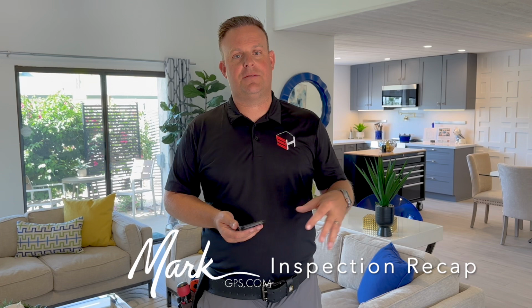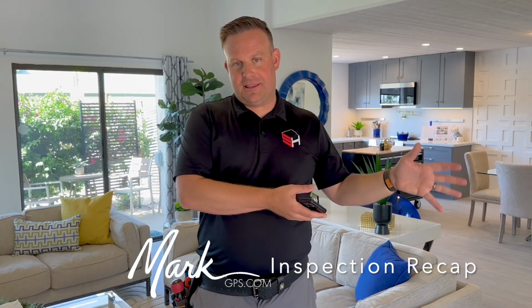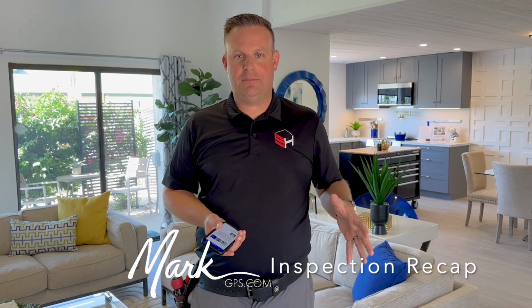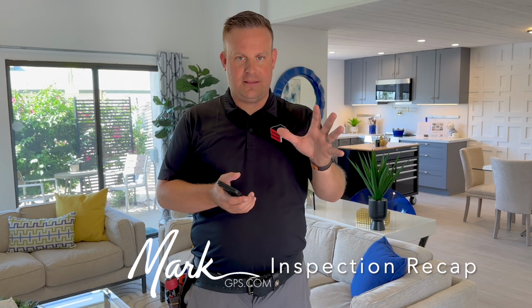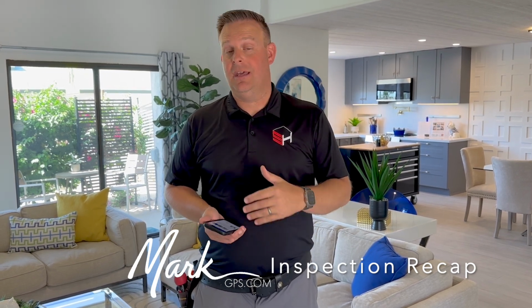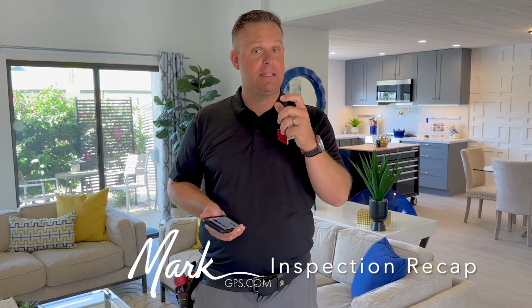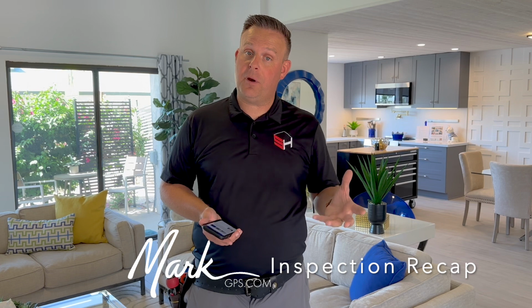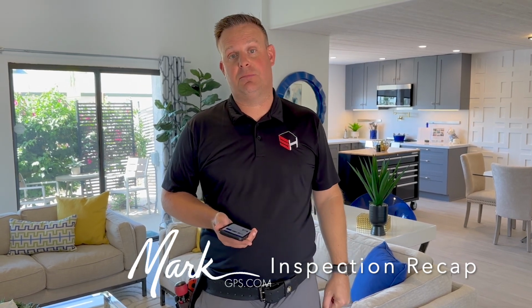You'll see that has a narrative that says, hey, they've been known to fail. I always tell my clients, go online, read about them. They'll try to scare you with, oh, this and that. I opened up the panel, I used my thermal imager, I didn't see any signs of excessive heat. Everything looked really, really good. If you're concerned, you can always contact an electrician and they can sometimes just replace the breakers with the more modern breaker. They're just retrofits and they can fit and alleviate those problems.